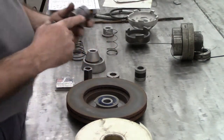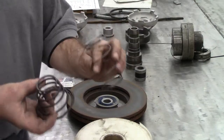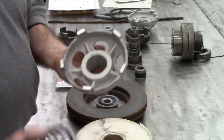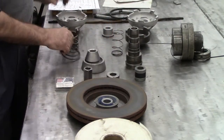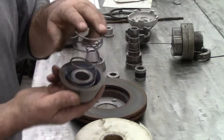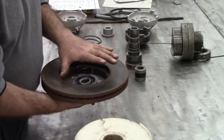These radiuses and tapers must have no dings or damage of any kind, because that would offset the hubs and rotors so they wouldn't be clean when finished. You also have two different types of springs available depending on your setup. This cone-shaped one sets inside one of our floating hub adapters. The smaller one might fall into the center, so be selective. The correct spring goes nicely down over the shoulder of the tapered adapter. This spring pushes the centering device into the taper to keep it from moving radially.